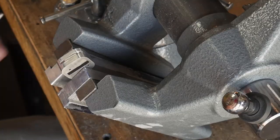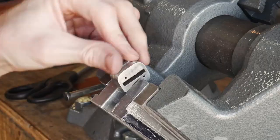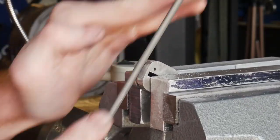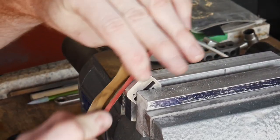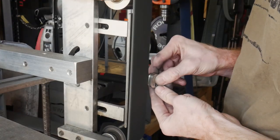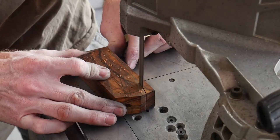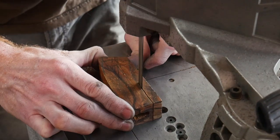I then worked through that groove with a round file, needle file, and then moved up to a three-sixteenths inch chainsaw file. Keeping this groove at a uniform depth around the spacer was actually way more difficult than I thought, and this is a technique I'll have to practice in the future. After getting all the fittings up to a 320 grit finish I took them to the Scotch-Brite belt to smooth out the finish and give it a satin look.